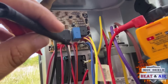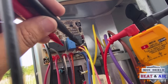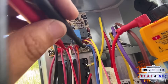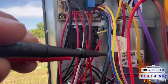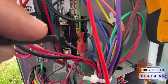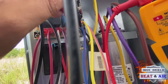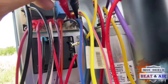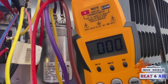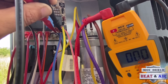The Y goes into this board, goes through its circuitry, through its safeties — if the safeties are okay, it should be putting out 24 volts to our CNT, which goes down to our contactor. That's the blue and pink wire on this Goodman GSZB4 system going to the side of this contactor, calling for cooling. We're going to go to common and then to our CNT. CNT is the call coming out from this board to our contactor — and we have nothing. No voltage going to our contactor. This could be a number of things: it could be a safety switch locking this out so the compressor doesn't cause damage if it's low on refrigerant.